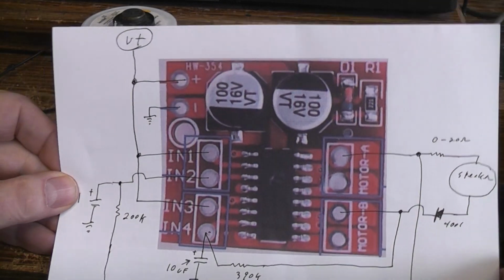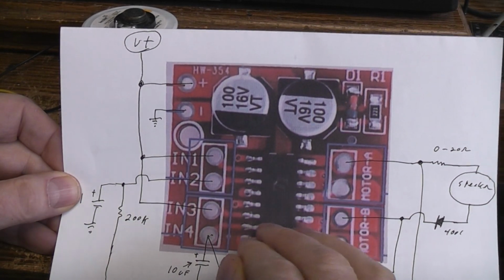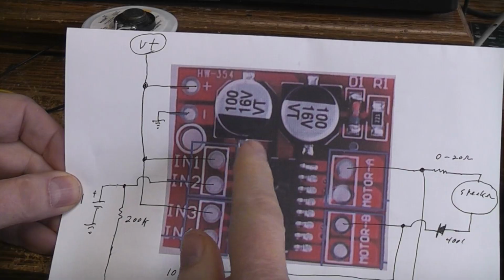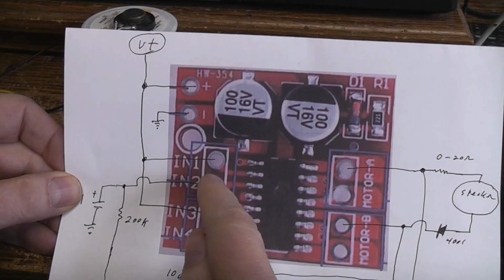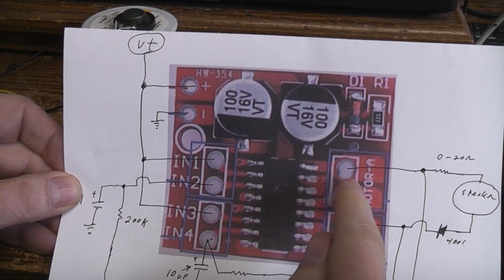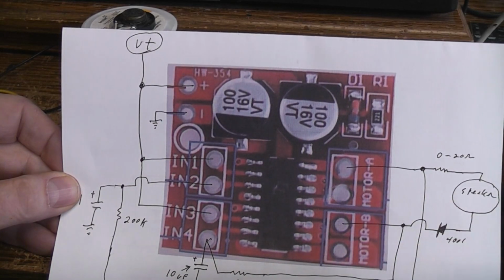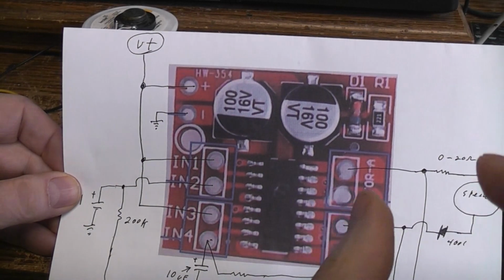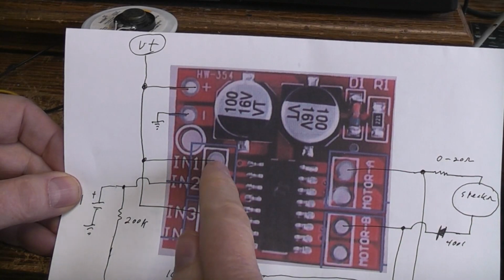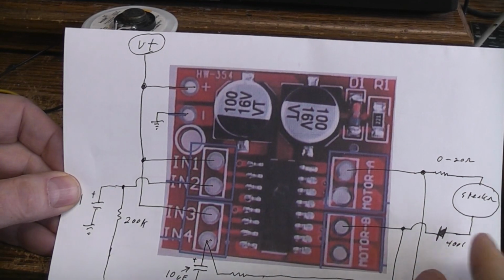So what else can we say? I think if you watch the other videos, I cover how the logic works in these things. But the long and the short of it is there are 2 separate circuits in this chip. The upper one, input 1 and 2 and output 1 and 2. If both inputs are positive, it throws it in what they consider a braking state, which is normally meant for driving motors. So both outputs will then go low, which would short the motor wiring together. So if a motor was trying to freewheel and act like a generator, those wires being shorted together would cause a braking function. In other words, stop it right away. There's also an open circuit function. If both of these, input 1 and 2, are both made low at the same time, then you get an open circuit in there, no connection at all.